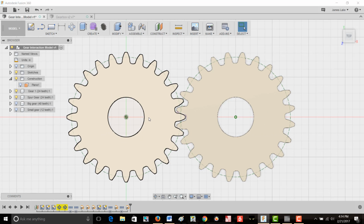as the input gear. This choice is a compromise between large overall size and the higher velocities that will be necessary with smaller gears. And for all these reasons, I've chosen to use idlers at the same size as the input and output gears. This choice has a further benefit in that it allows all the gears in the gearbox to be identical, which will make building them considerably less complex.